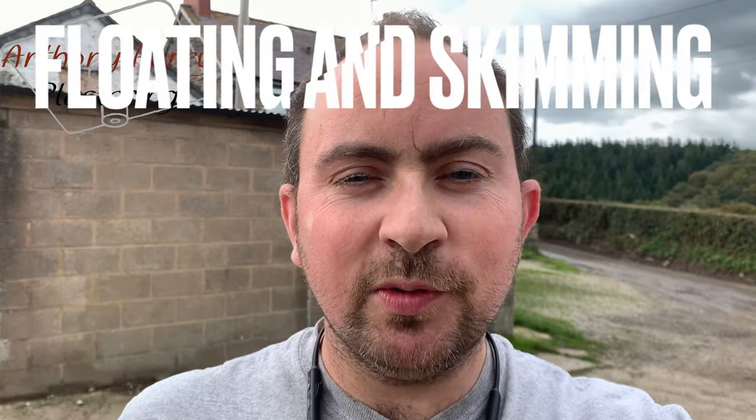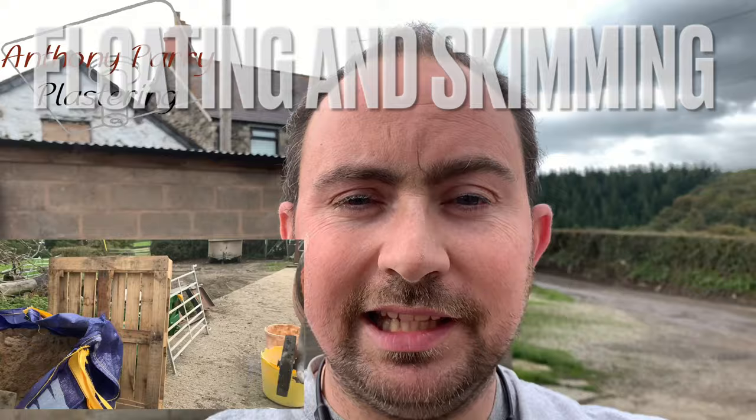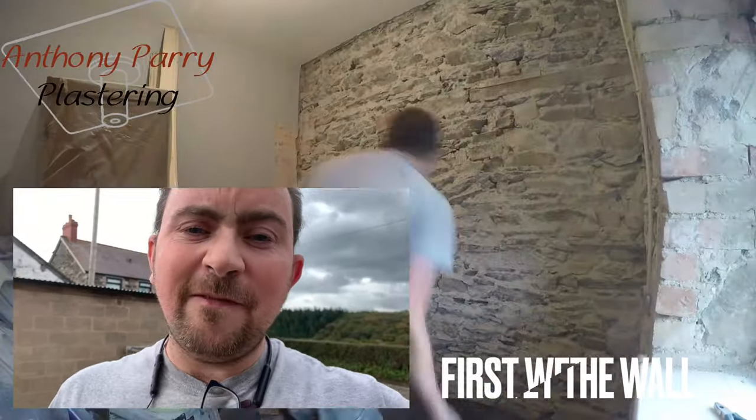So in this video you're going to see me putting some Sika 1 render onto the wall. This is basically sand cement but with the Sika 1 additive inside, so this is going to make it waterproof. First coat is going to be fairly thin.